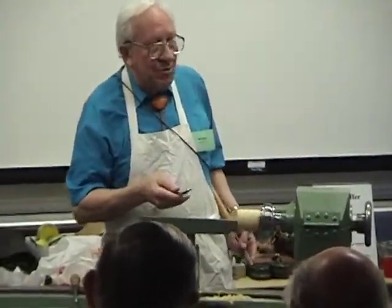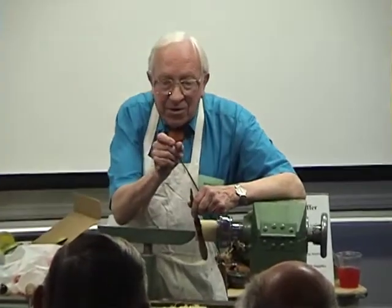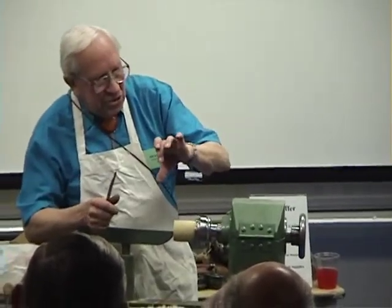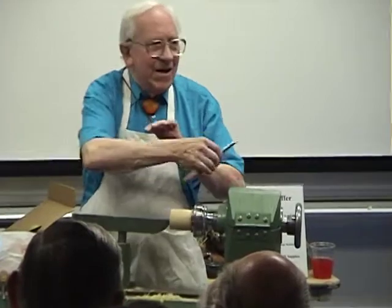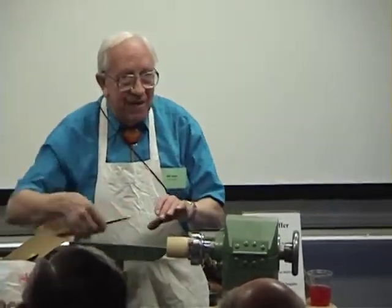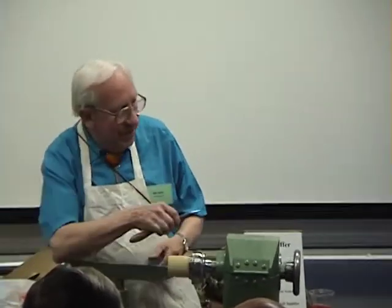Because although I've been turning threads all my life, the thought always comes into my mind: I wonder if I'm going to be successful this time. I've only got a covered thread on a quarter of an inch. Now, if you want to learn to cut inside threads, put a ring or something in the chuck so there's no bottom to worry about. Then you slide it right the way along and it makes a perfect thread after one, two, three, or four times. As soon as you've struck that perfect thread once, you can cut it away again, do the same thing with the same traverse, and get a perfect thread.